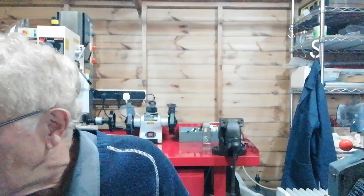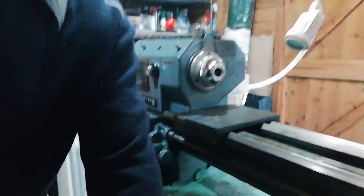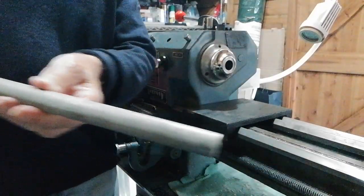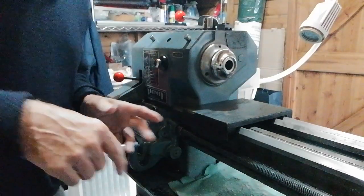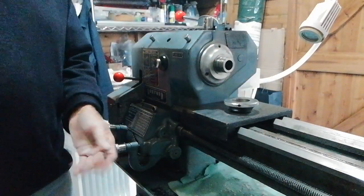So that's the way to do it. Now we've got to remove the spindle protector completely, remove that, take out the knocking bar, and then — we've already released it earlier — I'll just screw it off. That's it. And that's how to do the removal process. Now it's ready to mount another chuck, which we will be doing shortly, because we've got to address another factor.